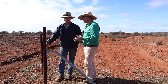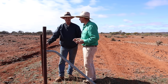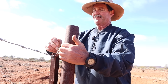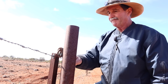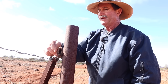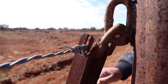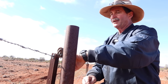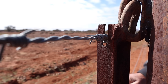The two chain links are the genius part. A full chain link is welded vertically onto the post. The second chain link — the one onto the star picket — has the bottom cut out of it, and the top of the link angles slightly away from parallel with the star picket. That's because if the star picket is hanging off the bottom it's fine, but if there's upward pressure, the link sits up against the top. At this low point there's upward pressure on the star picket, so you need the bottom cut out of that chain link so it can hang square.